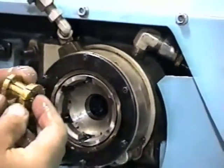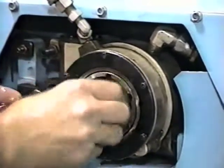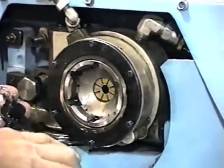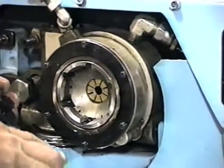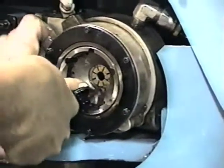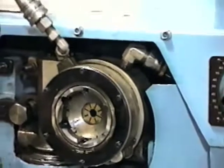Then I'm going to turn it about a quarter of a turn and that'll take care of it. The collet itself is a spring-loaded collet — it just fits in there. Take your snap ring and plier and install it. What that does is it just holds the collet and the bushing in place.